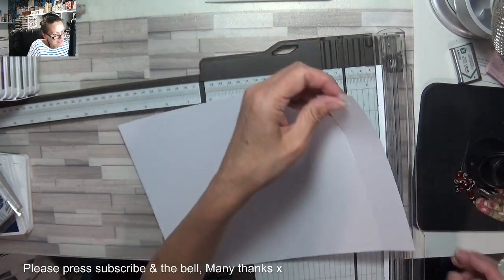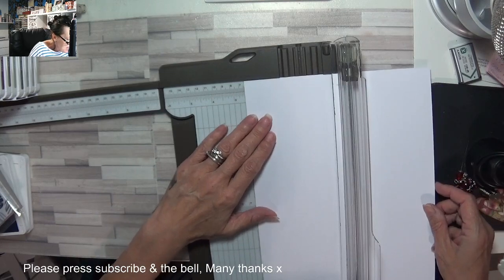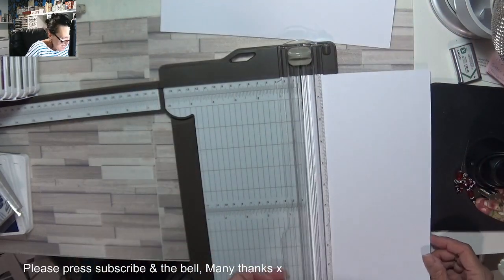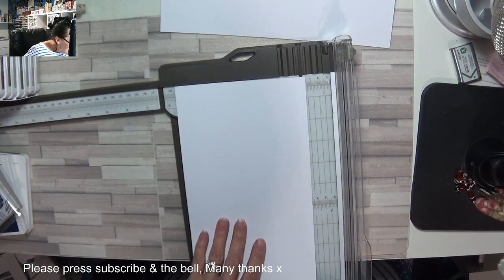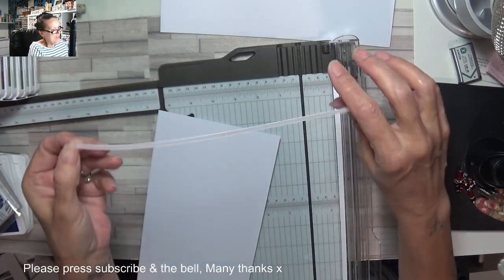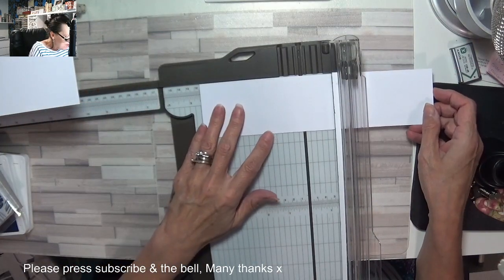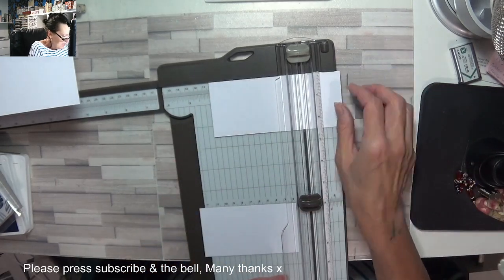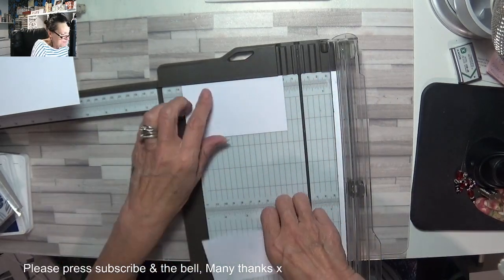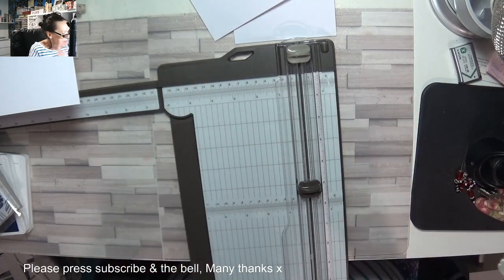You don't need this little section. Turn it to its side and then cut at two and a half. You need that because you're going to cut it again in a minute. Then take it out and cut this at five and five-eighths. So you're not getting that much waste from one sheet — just that little piece and the bit we just took off. That's going to be for your box. This now you want to cut down to four and a half. And again, four and a half. So not only are you getting your box, you're getting your little pen holders at the side as well. I haven't worked out the dimensions on the side yet to hide the joins, but we'll do all that together now.